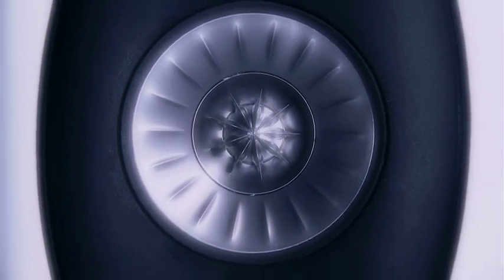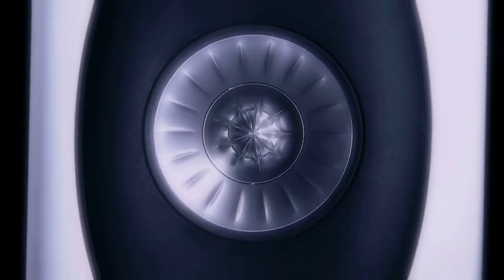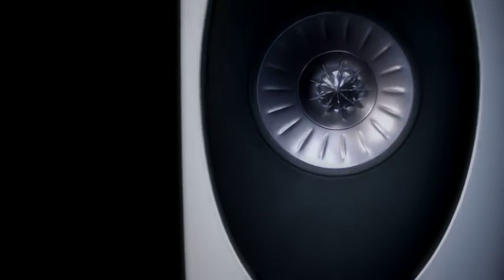The shape of the tweeter dome is carefully matched to the cone shape of the mid-range driver. On the outside of the mid-range driver there's a very small surround which then leads smoothly into the rest of the cabinet. In this entire surface there's no irregularity which could cause secondary radiation of the treble and blur the sound that the listener hears.